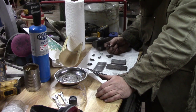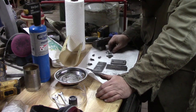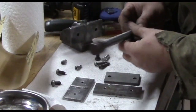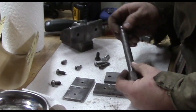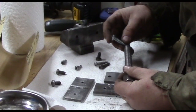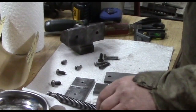This one little bolt, somebody has drilled the top of it for some unknown reason, and I found a replacement. It's just a little long. The very end of this one has been turned down a little so that it's smaller in diameter, where it'll run on this spot here. That's what moves this up and down. So we'll take care of that too. Basically you have to knock the threads off once you get it to the right length. But we'll work on that.